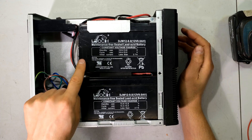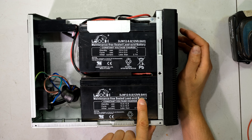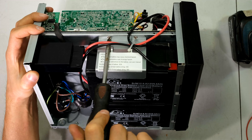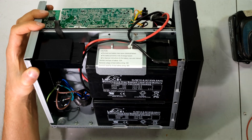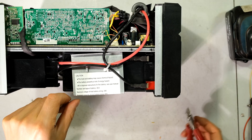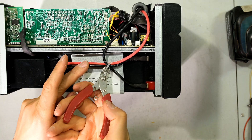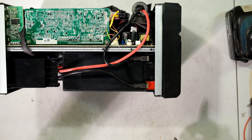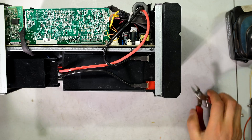On this unit there are only two batteries — 12 volt, 9 amp hour units. In order to replace them I need to remove this plate; there are two screws holding it in place. If the plate is in your way you can just cut this cable tie so that the plate can be removed from the unit. I'm going to remove that cable tie just to get this plate out of the way so it doesn't fall inwards and damage anything.